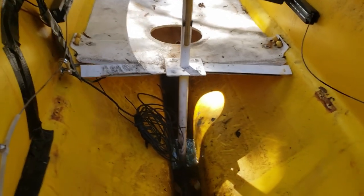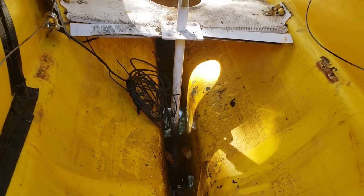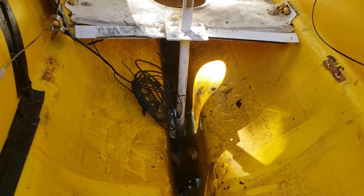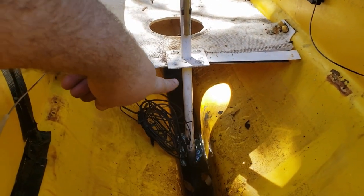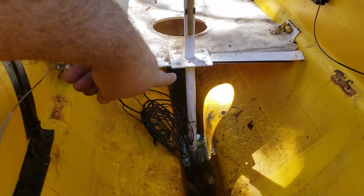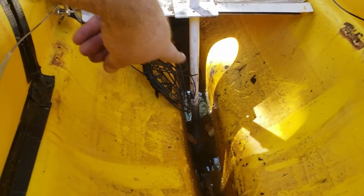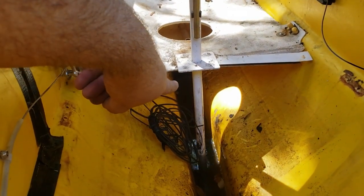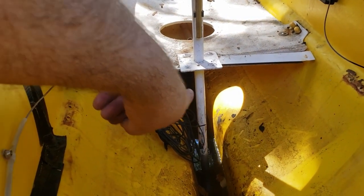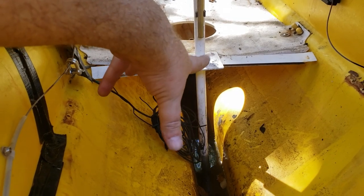Anyone with a Windrider 17 is familiar with the compression post. What I wanted to do is come off the compression post — the transducer was originally up ahead of it, put in with the plumber's putty. There's a T at the bottom of the compression post that spreads the weight out across the plastic, and it was right at the end of that T. I wanted to get a little farther out to get better performance off the transducer since it wasn't sitting right over top of metal.